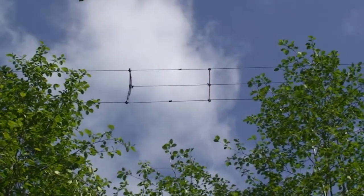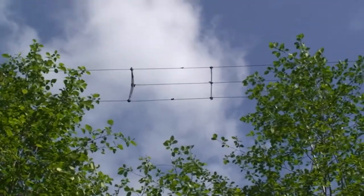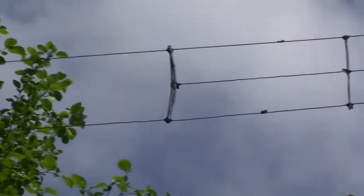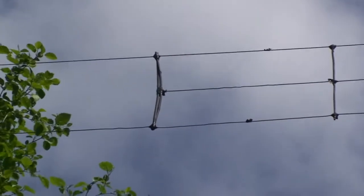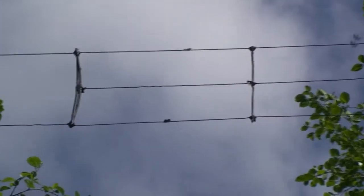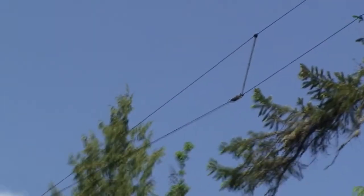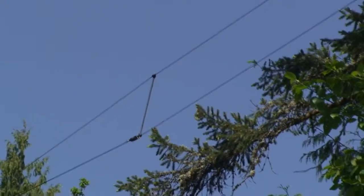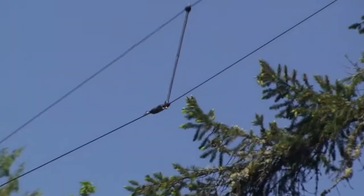The center is the 40-meter, and as you can see, it basically just took two bamboo sticks and then wrapped them together for support, pulled it tight, and then with an additional support there. Down here is where it drops to the 80-meter, and the bottom part with the insulator on it is the 80-meter, and then it's parachute cord running and pulling it tight.